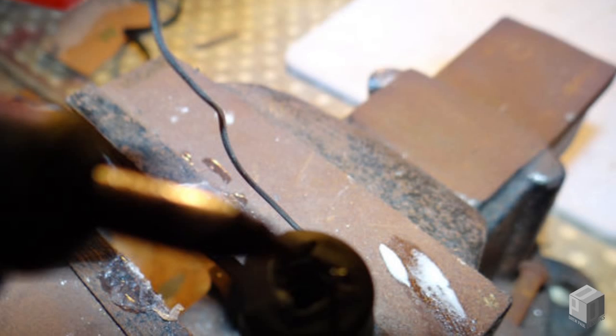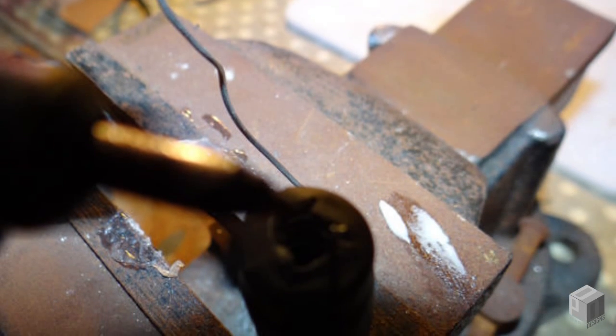Plug in your soldering iron and wait until hot. Secure your battery copper side up, the side you started with. You will then apply heat to the solder while holding it above the hole formed on the end of your battery. As it melts, press the solder into the hole until full and finish with a small bead of solder on top. Once cool, flip your battery over so the zinc side is up.